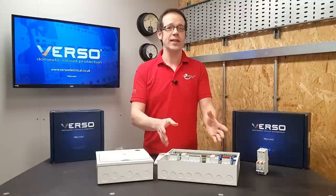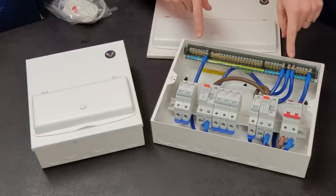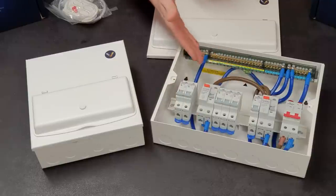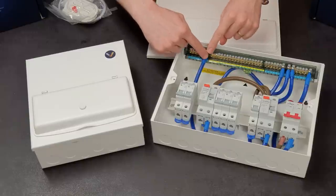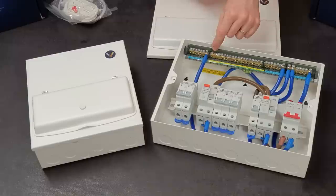To further increase the ease and neatness of the installation, in this split load board the neutral bar has been placed either side of the earth bar, which means that the circuit conductors fed off the second RCD don't need trailing across all the other conductors to get to the correct terminal. Looking at those terminals more closely, you can see that all of the internal tri-rated conductors are ferruled, meaning that the screws aren't going to be damaging those fine-stranded conductors.